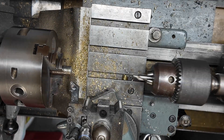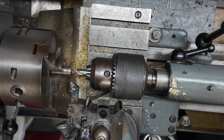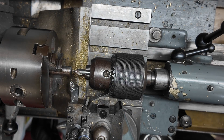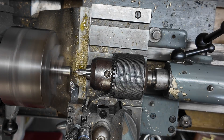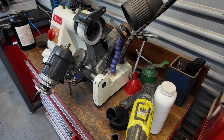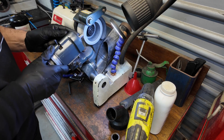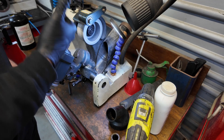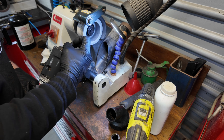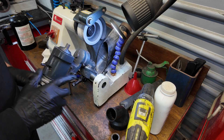I've got a bit of silver steel in the lathe. I'm going to use the centre drill, put a little cone in there and then make a tool. So we're in the D-bit grinder, got our little cutting tool set up - it's going to turn that way, right-hand thread. We want to cut up to the centre of that bottom edge; don't really care what the top edge does.